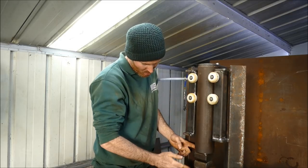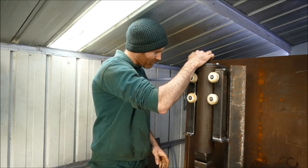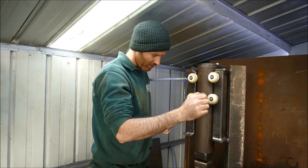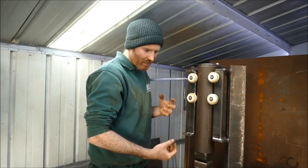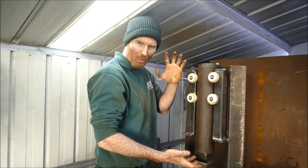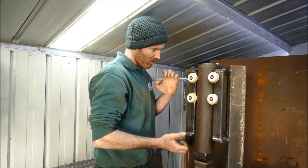Jobs are good, and we've made sure it's all kept in line by clamping the face on first. So bolted at the top, clamp on, face on there, put these posts on. Where they sit, we weld it on. And basically, the idea of having the bolts on previously was to account for sloppy fabrication. So it basically doesn't matter anymore, it's going to work fine.